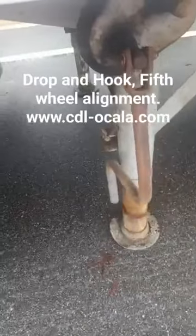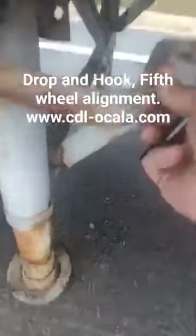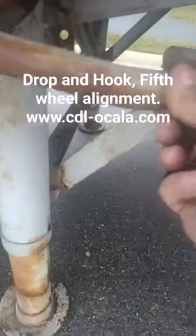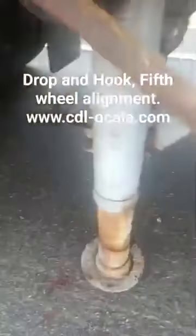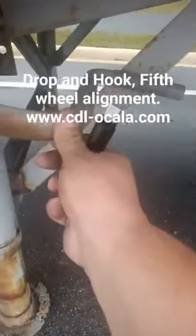So when I come up here, make sure the crank handle is kind of dangling. Sometimes you'll see trucks with the crank handle where the lock position is right here. Same thing goes for that. I'm going to leave it hanging, because if I put it here and the guy in the forklift pulls into the truck, this thing goes up, look. I can't get it from underneath.